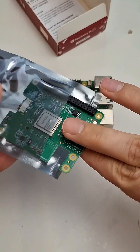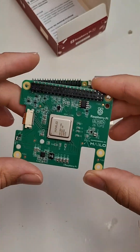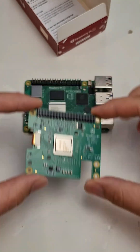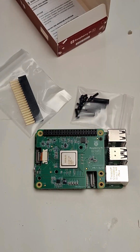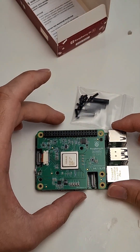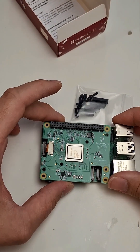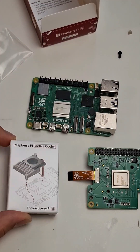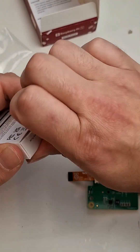This plus the Raspberry Pi 5 comes to about the same price as the original Jetson Nano I was using, but it's a lot more powerful — 26 TOPs versus the half a TOP I was using with the Jetson Nano. This is designed to sit on top of the Raspberry Pi and connect via PCIe port. It also comes with a header pin extender, so there's enough clearance underneath the hat for an active cooler, because we're going to need active cooling for this.